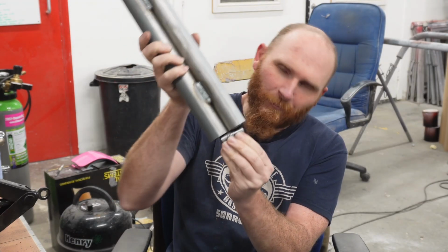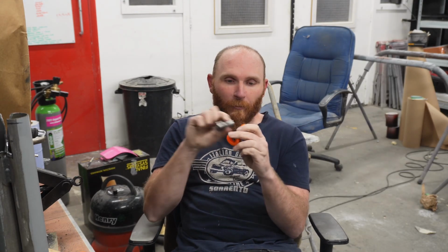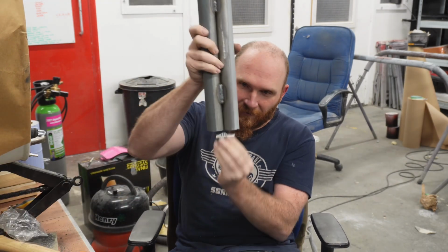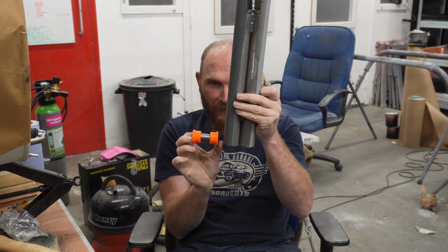Basically, weld at the bottom of that. Because if you imagine, you got the 2 sides of the swing arm, then you have your 2 bushes, and then the bolt will go through them, through the middle of this bit, and then into the other bush that's in the other side of the swing arm, if you get me. And I ordered these bits, so these will get welded on the end of the swing arm, and these are for the bushes to go into.